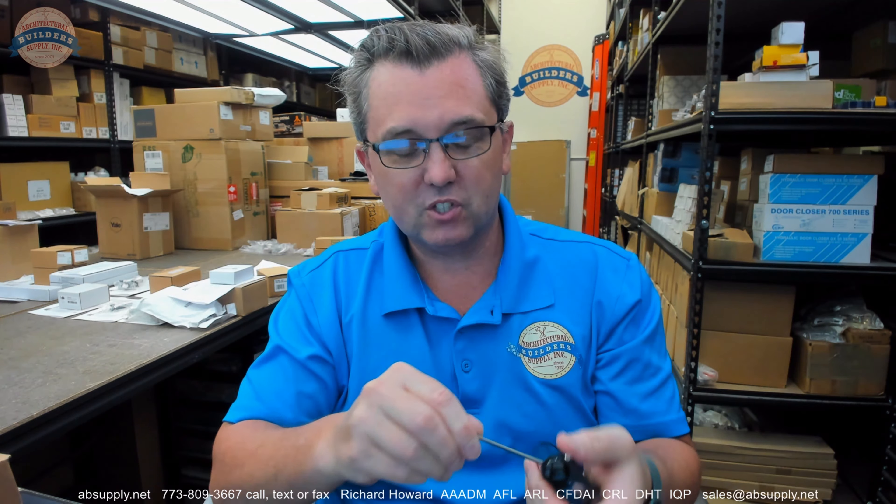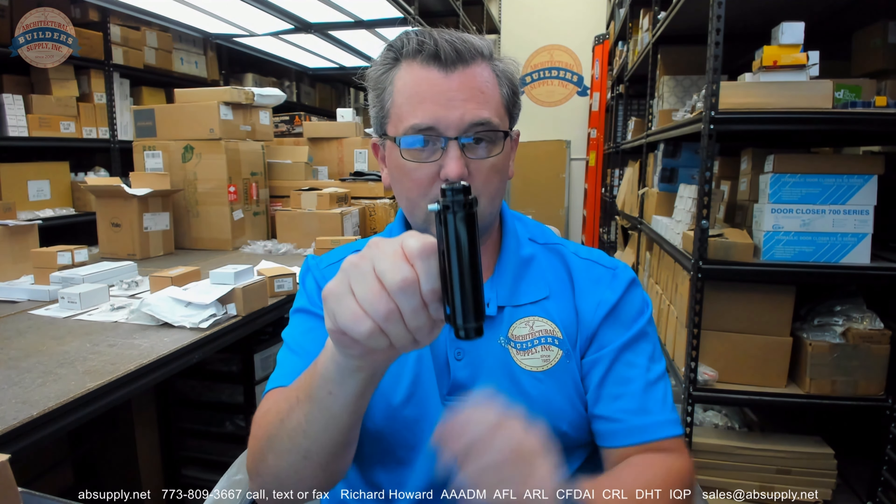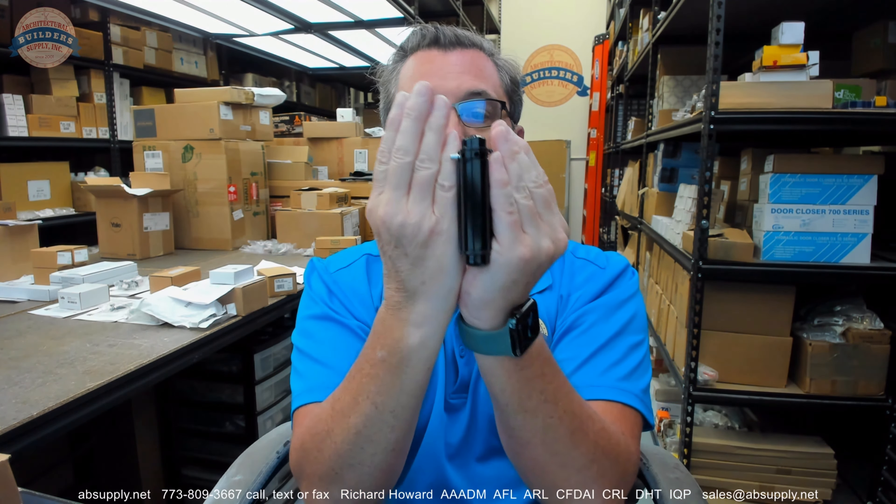So you want to be careful doing that. Sorry for the scare. We've got the tension increased. Now I only have one hole of tension — I can spread that out and it'll snap back closed. And that's exactly what you're going to see on the outside when your door is in the closed position. So every time this client goes to open his door, it's certainly going to come back and close.